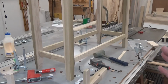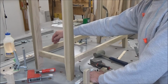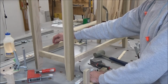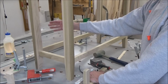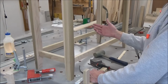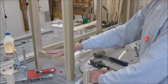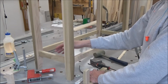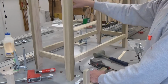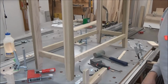Make these panels first. And incidentally, the panel, what I ended up with was a 1/2 inch plywood. MDO, it's called signboard. It's got a little paper skin on it to take paint really well. So that 1/2 inch will give me room to put a 1/4 inch deep groove in there to set my shelf into.